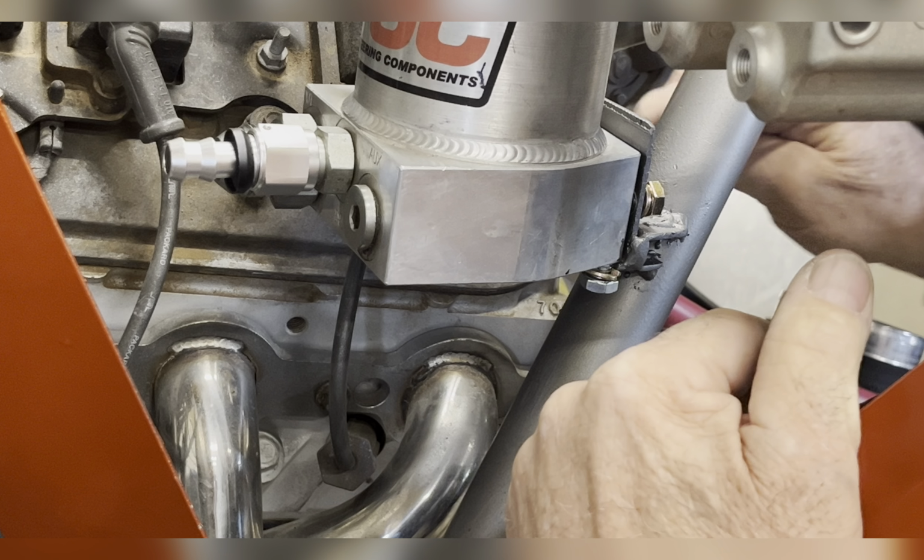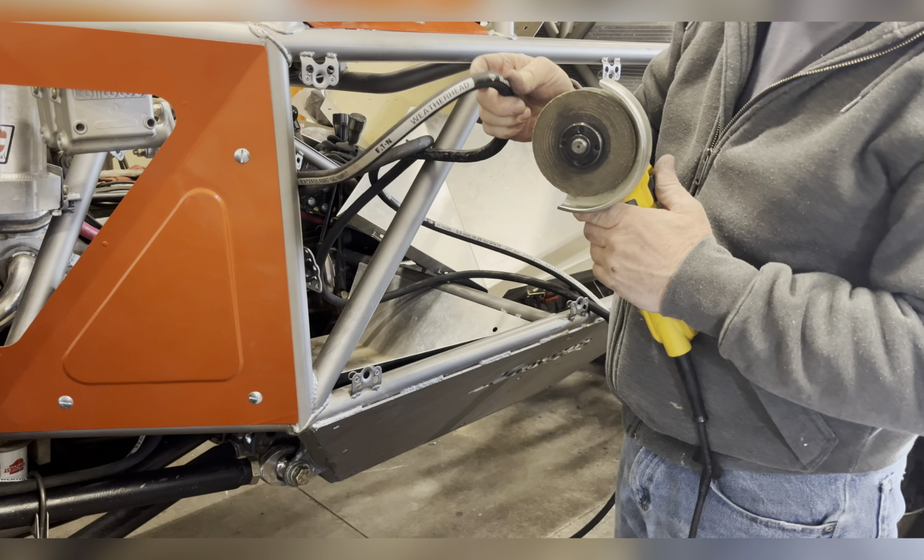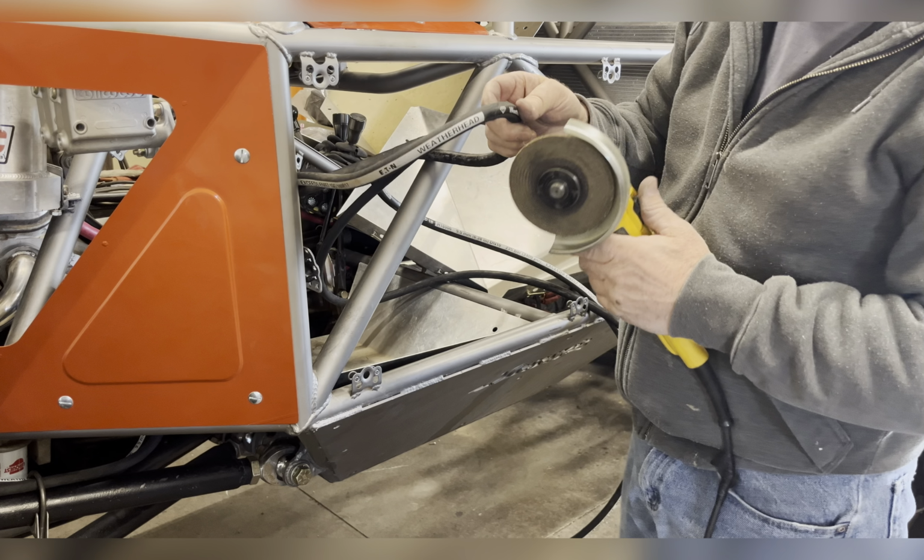The orbital valve was already mounted in this chassis, but now I need to start running lines from the pumps, reservoirs, and cylinders. Trying to fit these as tight as I can and still giving them all the travel they need. It's handy to have a vise that you can move around the shop. That way I don't have to take the whole line out to build this end.